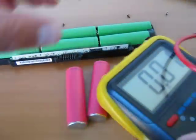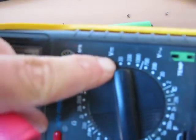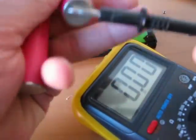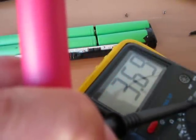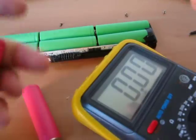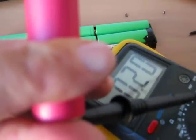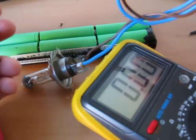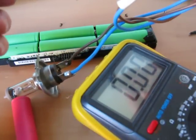If you take this multimeter set to volts, it's on the 20-volt measurement range now. This cell is superb — it's almost 3.7 volts. And another one is 0.2 volts. Many times we can judge from the voltage that one of the cells is defective.